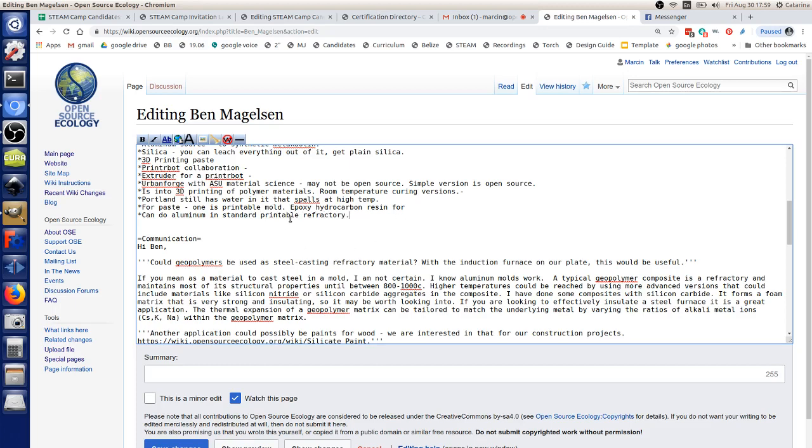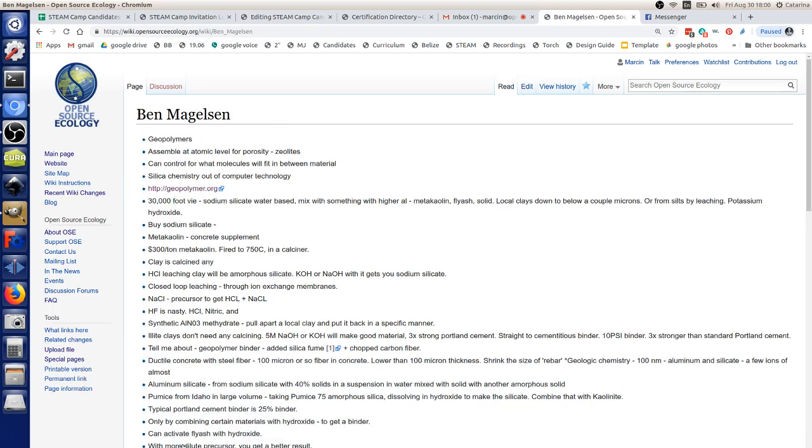Crucibles could be a profit center too. Graphite crucibles — you could use this kind of thing to build them, and those are somewhat expensive if you want to buy one, so you could produce them cheaply. When you get to a material that's relatively strong — much stronger than plastic, and pretty structural to about 1,000 degrees Celsius, though it starts losing some strength at 800°C — there are all kinds of things you could build. For things like barbecues, rocket stoves, and similar lower-temperature applications, geopolymers would be really better than what's commercially available today. They're essentially a fireproof refractory plastic.